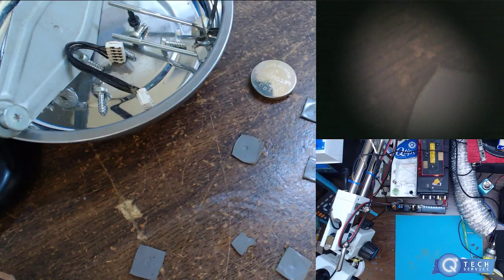Once in a great, great while you will have problems, especially on the MacBooks, because they have no printed out area for aligning the chips. So it's a good idea to either mark the chip before you take it off, but that's kind of hard to do. The best thing, if you don't get it too dirty, is to place tape along the edges. Yeah, mark the boards, you have to.